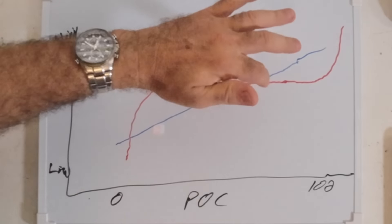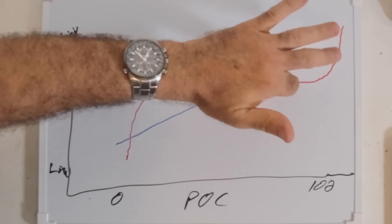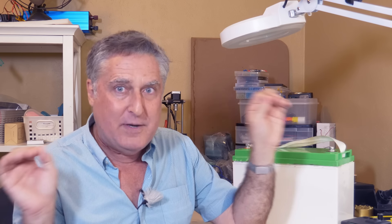This situation where you're charging slowly and you let the voltage come up above that really low voltage number — you're fully charged but you kind of can't tell by voltage — we refer to that as low current overcharge. It seems to be the number one killer of lithium iron phosphate batteries. What's happening is you're over 100% charged but since you're pushing so little current, you're not seeing a big voltage jump right away. It just kind of cooks the chemistry at above activation energy but with no capacity to accept the power anymore.